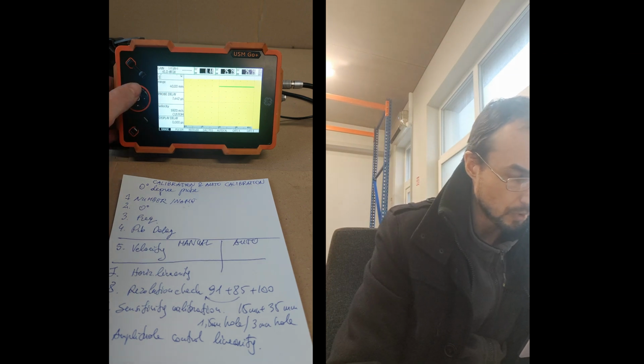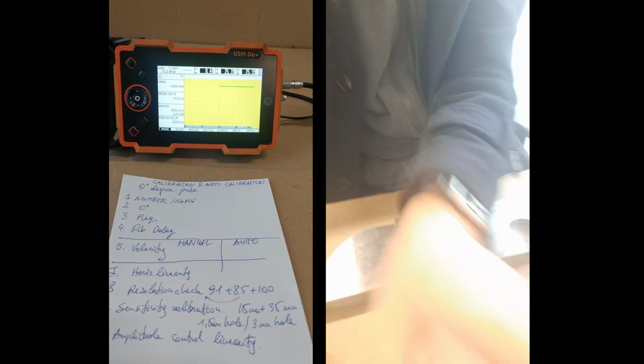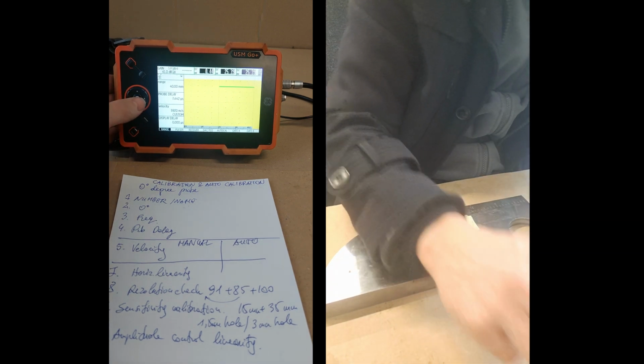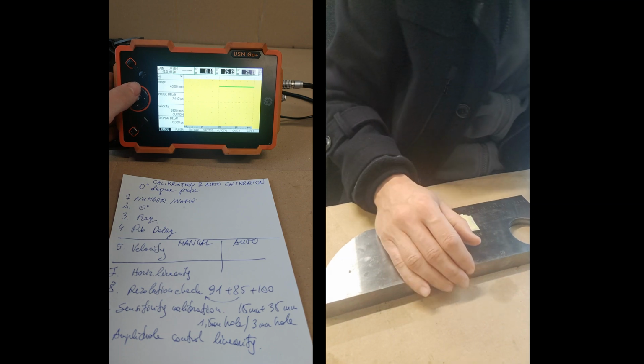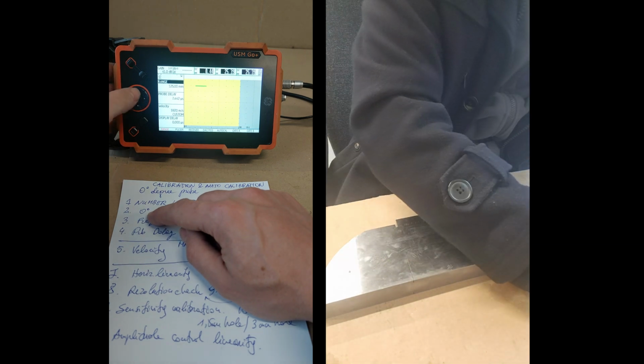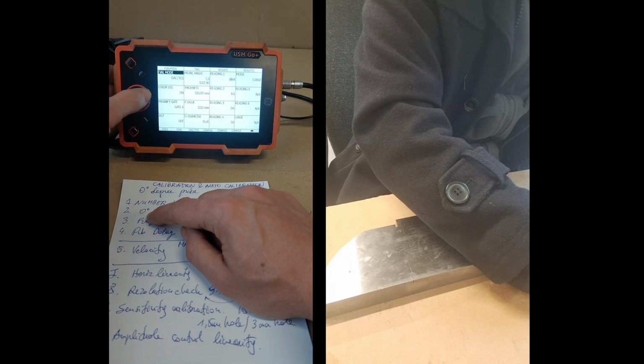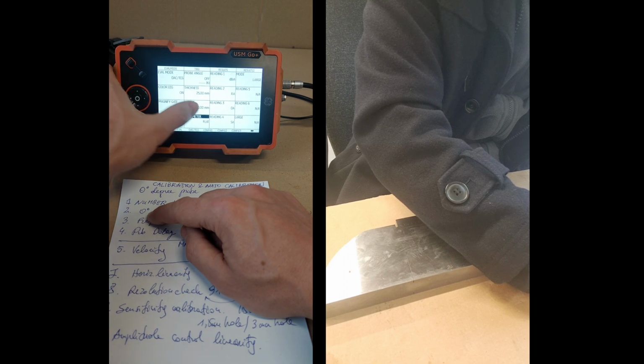Probe delay, range. Well, range we need 100 because I'm using the number 1 calibration block, so we need 4 or 6 spikes. Okay, so I increase the range to, let's say, 125. 0 degrees, that's in the big menu. I go to the big menu. No, not this way, go down, and now maybe. Here you go. Eval 1, okay, let's do 0. Thickness, but we won't see that here because there will be no legs, I think. X value is 0.